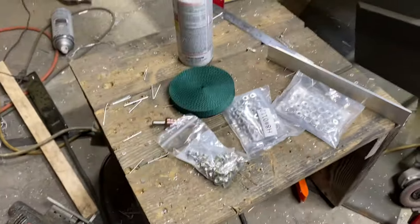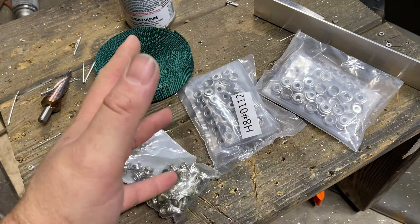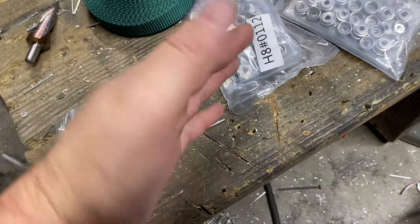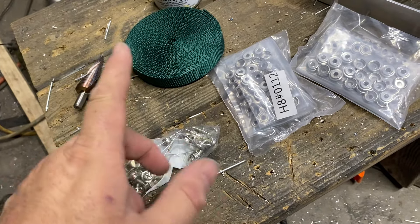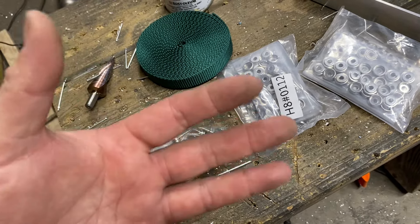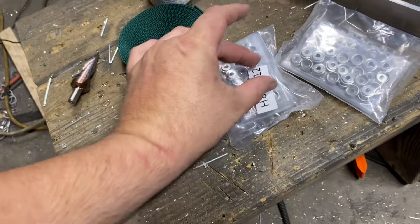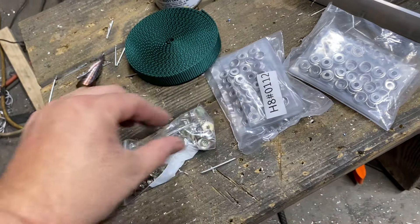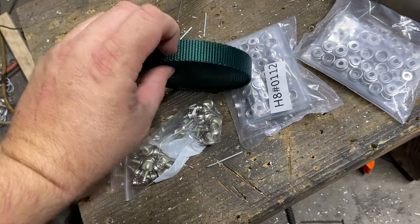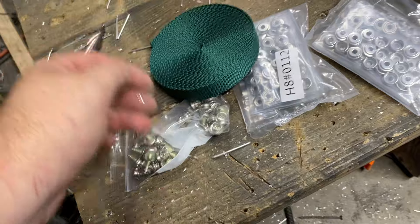Here's some stuff I've picked up from your donations. If you look at the B-36 around the flight engineer, over the top around the astrodome mount, you'll see these three-eighths inch snaps. Those are so they could attach the various curtains — they had a curtain that went all the way around the astrodome so the navigator could get up there and use his light without blinding the pilots. A lot of the snaps are on steel belts, not aluminum channel strips. Some of them are on nylon, so I got this nylon and I'm going to press them in — spacing is about an inch and a half to two inches.